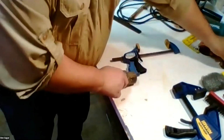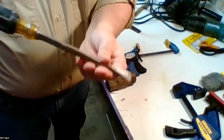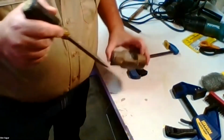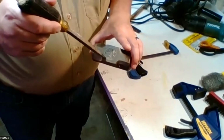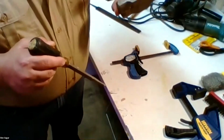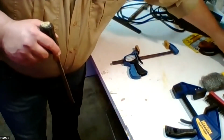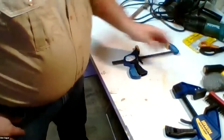And then whether you have a hole punch, I have a big machinist screwdriver that I tend to use as a rough chisel. I will come in with this and a hammer and try to bust out the pieces of this in order to clean it out. And this is all true for smaller hammers like this, for sledgehammers or wood splitting mauls, anything that is affixed using epoxy.